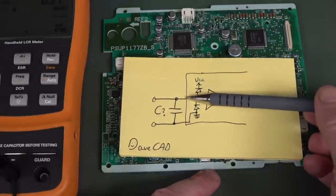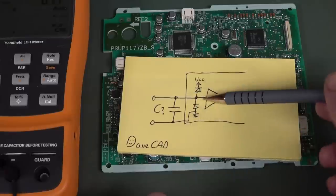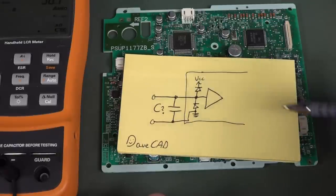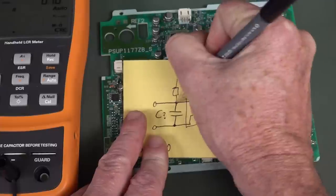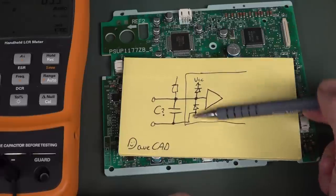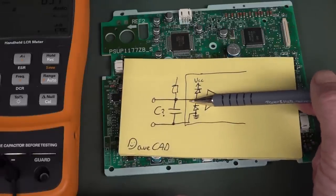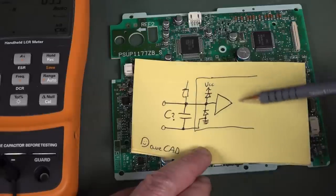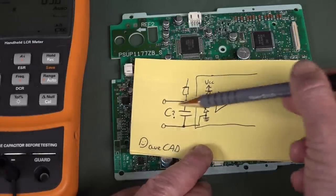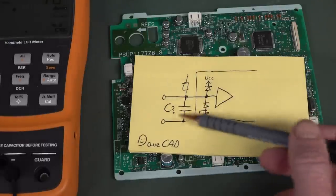Capacitors in circuit actually have active components around them — voltage regulators, or perhaps the reset pin of a microcontroller with an RC startup circuit. You want to measure that cap in circuit to see if it's good or gone bust. Inside chips, you can have ESD protection diodes, and active parts. Effectively you can have one or two diodes in parallel with the capacitor you're trying to measure. If you've got too high a test voltage, that's going to clip it.